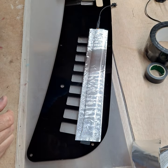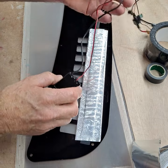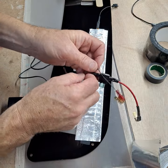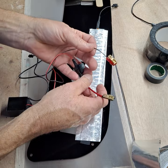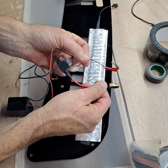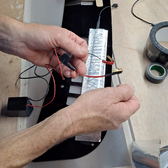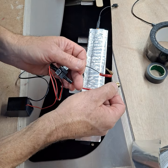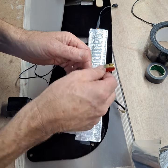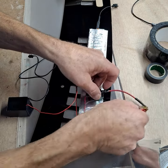The way these hook up: this is your inverter assembly. There are very thin positive and negative leads that power this inverter assembly with 12 volts. They'll have piggyback terminals on them so you can put these right on the back of an existing switch like your nav lights. You'll pull off your output wire from your nav light switch, put it onto here, and put both of them back onto that output. The ground is going to be the same way — just pull any ground off, stick it on here, and put that on the switch, so you'll have power and ground.